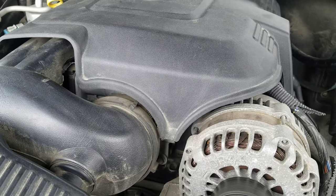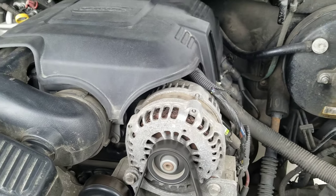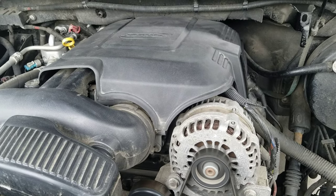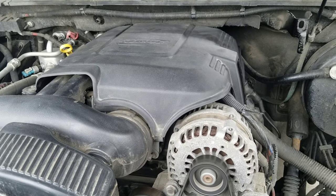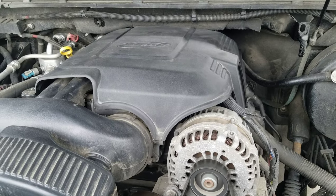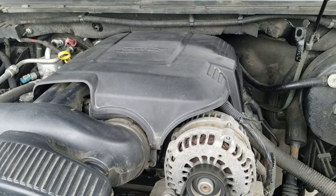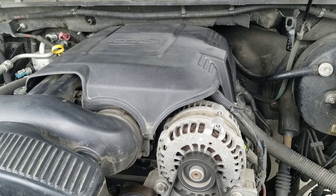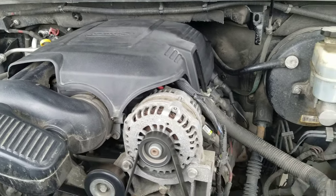You can hear — there's no noise. It's not ticking, it's not knocking, it's not banging around. So what I'm going to do is run a quart of ATF in it just to clean it out. Maybe there's sludge, mineral deposits, maybe there's something just tripping up the sensor. I'm going to run that through it for about 10 minutes. I'm already full on oil, but I think just one quart of ATF shouldn't be a problem. And then I'm going to change the oil and we'll go from there and see what's going on.